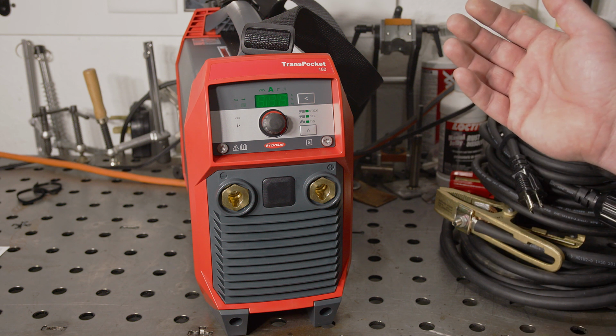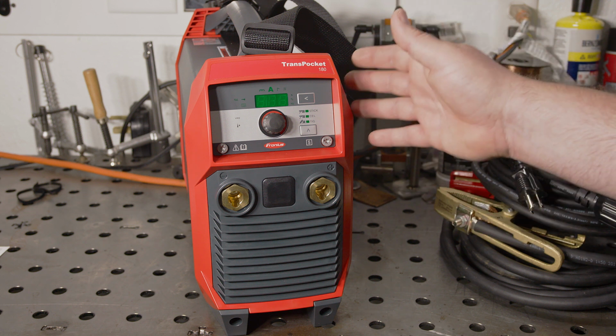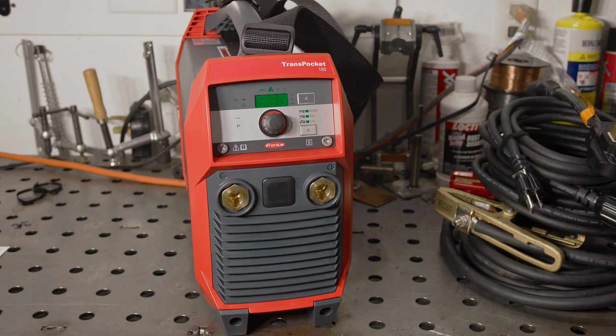With this welder, you can actually set how high the voltage has to get before the welder will turn the arc off. This setting can be turned up to allow a longer arc or turned down to give cleaner stops when snapping out. This could be particularly helpful when snapping out in TIG mode. Rather than having to violently snap out like with some lift arc machines, you can set this one so it only requires a moderate lengthening of the arc for the arc to turn off. This can help prevent a loss of shielding at the end of a weld.